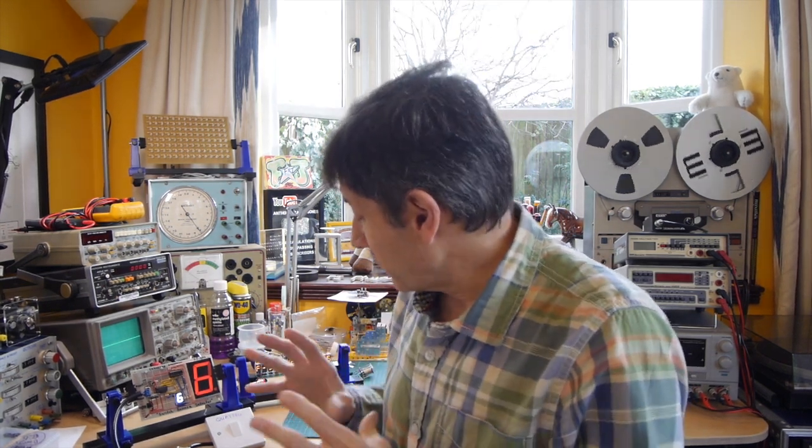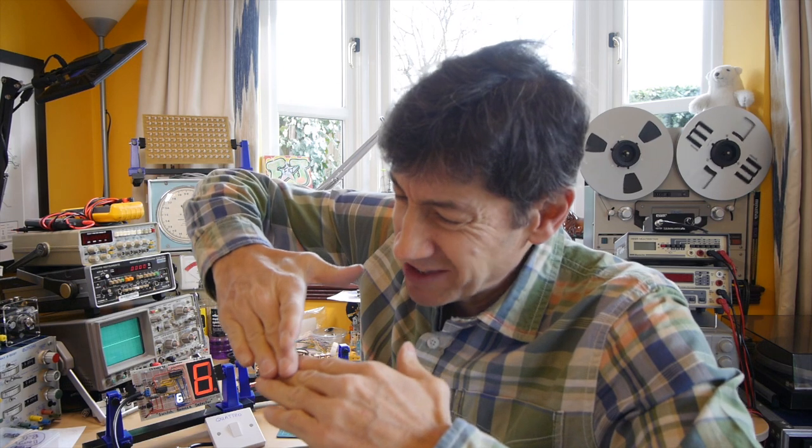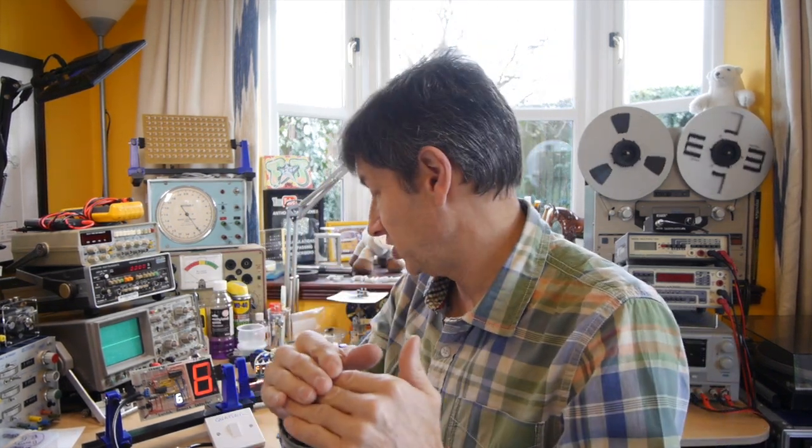You might ask how rapidly this is measuring. Well, this circuit measures at least about five million times a second, so it should be capable of detecting multiple bounces. There's another thing going on here that's really quite complex. There may be some oxide on the switch contacts, so they sort of contact but not very well, then they disconnect and not very well contact again. This process can happen a few times until you get a really good connection.